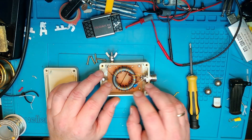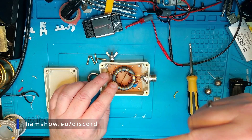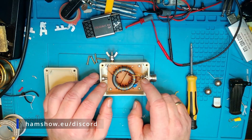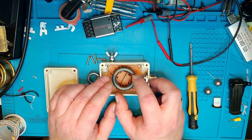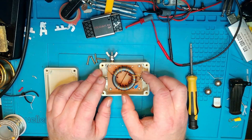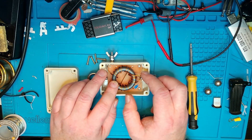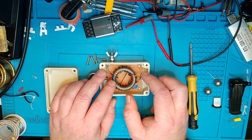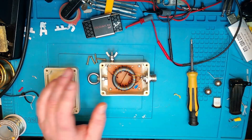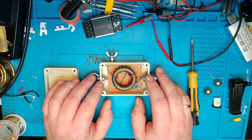If we look at the windings — I posted a picture of this in the DIY section of the European Ham Radio Show Discord. If you want to join that Discord, the address is hamshow.eu/discord. The winding is not particularly neat, but it is wound correctly, and the solder joints actually look legit — they look good. At the same time, it looks like something a beginner would build, not necessarily something you'd buy. There's also another problem: this toroid. There is no way of knowing what mix this toroid is, so we won't know anything about its performance just by looking at it. But it looks legit — it looks like it should work.